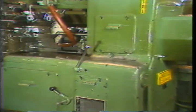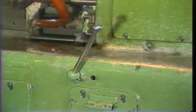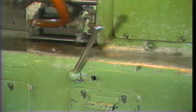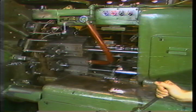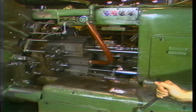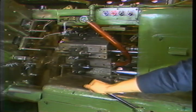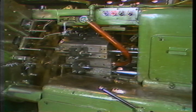This is the feed control lever. The feed control lever enables you to start and stop the movement of the machine's components. The spindles will continue to rotate after the lever has been disengaged. Be sure the coolant is flowing before you engage the feed control lever.